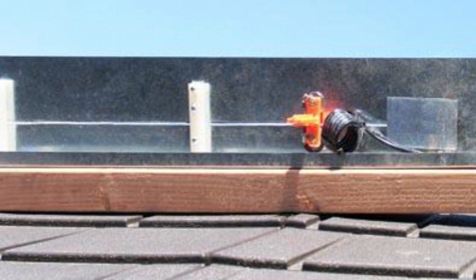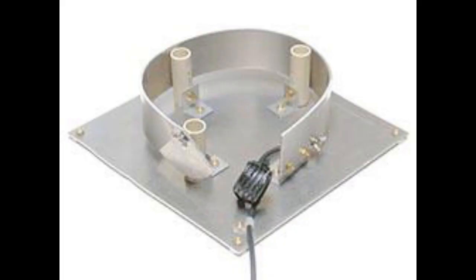And this one is a quarter wave. The other one's a half wave, and they work both in quarter. This one is an interesting one. The slot is the space between that little partial cylinder and that sheet at the base. But it works exactly the same. These are great for the top of RVs because you're not going to knock one of these off riding by a tree. And you don't need a metal ground plane under this one. It works without the ground plane. It's self-contained. That is pretty amazing. Super stuff.